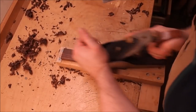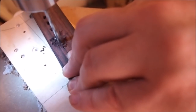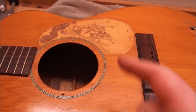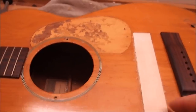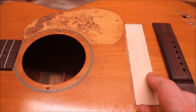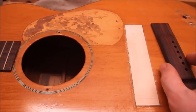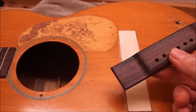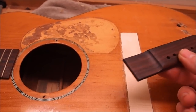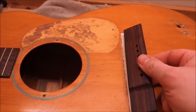In the meantime, I'm also making the bridge — planing it and drilling it. I pulled off the pick guard because it was getting in the way of leveling the patch. I scraped and sanded it so it's in the same plane as the top. It's all ready for the glue-up. I finished the bridge — I forgot to film the portion where I was sanding the wings down on the spindle sander, but no big deal.